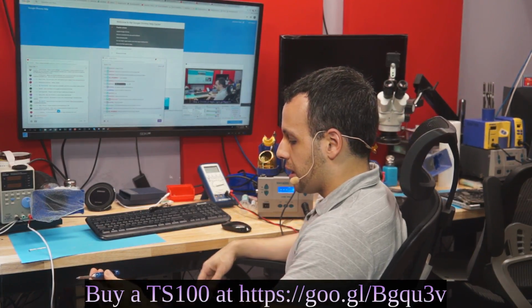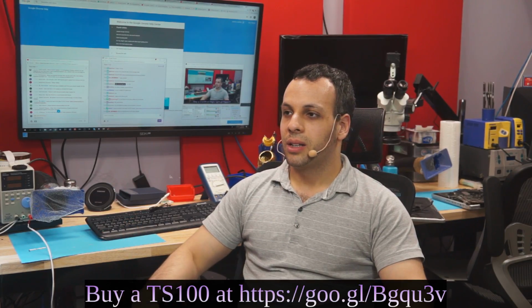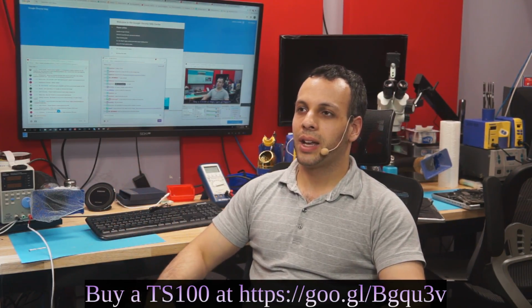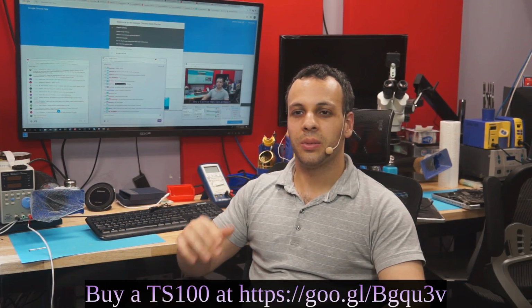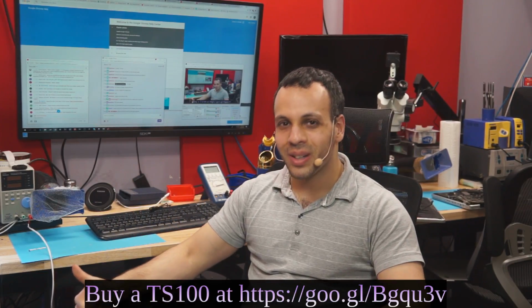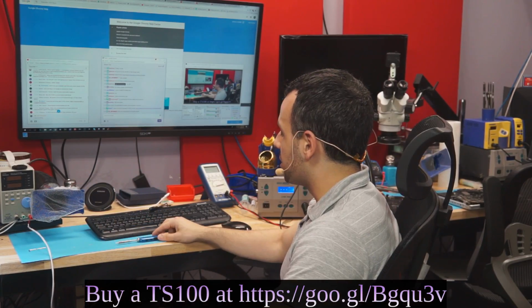So for example, I have a thermal printer that requires 19 volts. I thought, okay, the power supply to it died. Let me just get this big Toshiba brick laptop power supply that I have and attach it. Wouldn't print labels right, it would stop halfway through. Tried a Lenovo one, would stop halfway through. Tried an HP one, it stopped halfway through. And then I finally found some large Dell one or something that was able to do it.